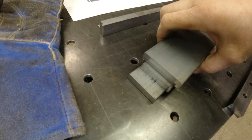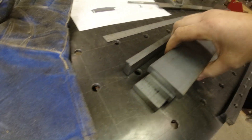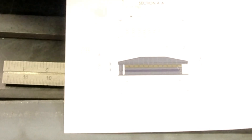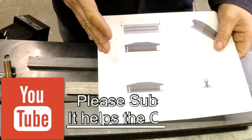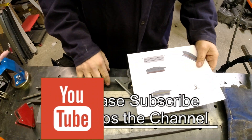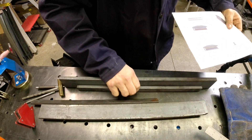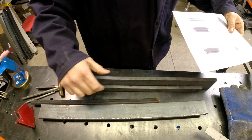We've cut all the material for the bending fixture. A lot of this is half-inch hot rolled steel. We have to lay out all these bolt holes. When this thing comes to the bend, instead of one solid bar, there'll be these two rails with the other piece in the center, and we'll have bolts in one end.